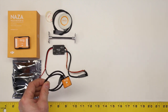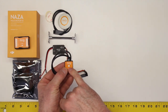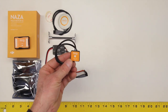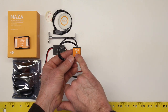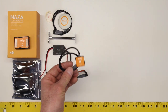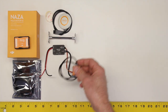Next in the box as you're unpackaging its contents you'll have the remote LED. The remote LED has a single LED surface mounted — it's very bright, it's capable of displaying multiple colors — and the Naza uses that LED to communicate with the pilot what the condition of the helicopter is. So if the helicopter has a low voltage condition, or if you don't have enough satellites to maintain a GPS lock, that LED is going to flash certain colors and certain patterns. Knowing those patterns and the colors involved is very useful when you start setting it up and especially when you're out flying. On the end of the remote LED is a USB port, and that's what you use to hook up the Naza to your computer when it's time to set it up.